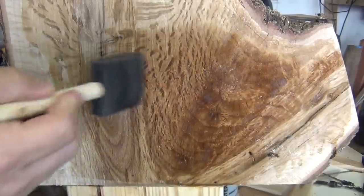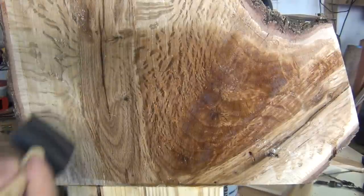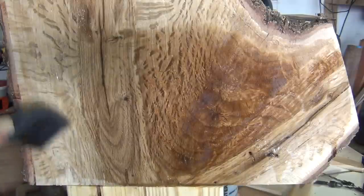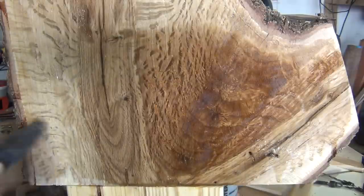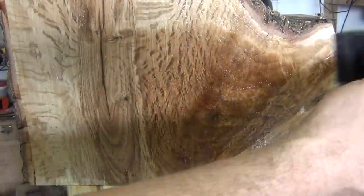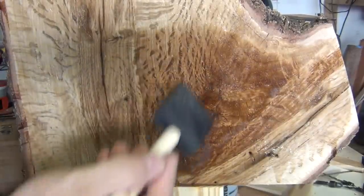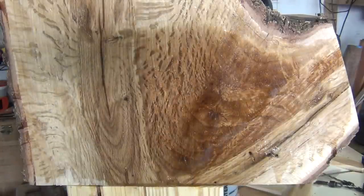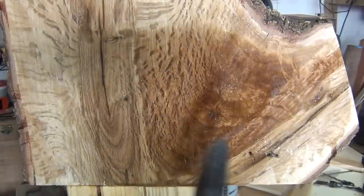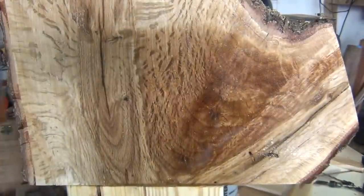This is just some nice beautiful grain as it is, but this here has a very nice tiger stripe to it. Now this piece right here is quarter sawn because of how I cut the logs. Another interesting thing to note is that inside of here there are some actual pieces where the grain split or something and it filled back in with some of the tree resin, so there are some black lines right in here that are actually solid — they're not gaps or wormholes.